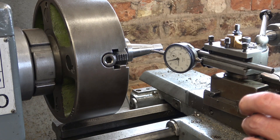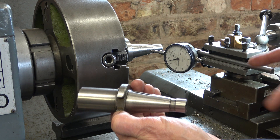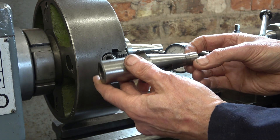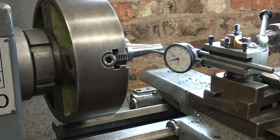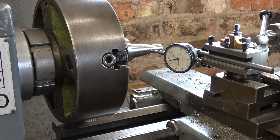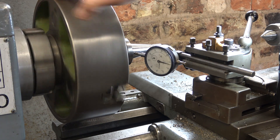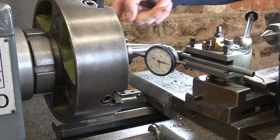On that topic of assume nothing, trust nothing — I was using this Morse Taper 2 adapter to clock the taper here, to set up the top slide on my lathe. I found that this isn't concentric with this, and to some extent not with this either. Although it's all very nicely finished and ground, this doesn't need to be, and it isn't. So I thought I'd look for something else, and I thought I'd definitely be able to trust my Jones and Shipman 27mm arbor, because both sides have to be concentric. But if I move it along, it's not running so true concentrically.